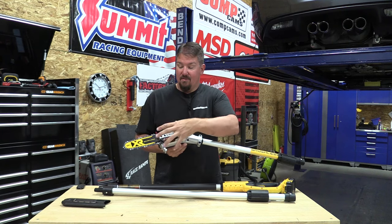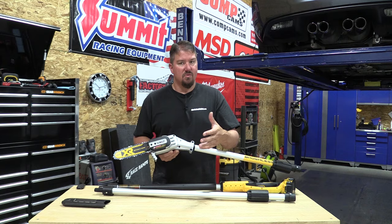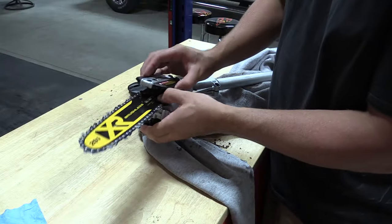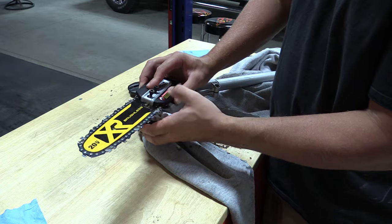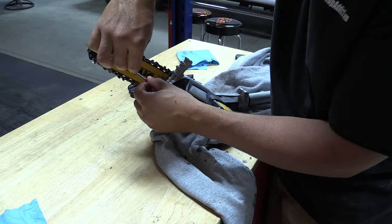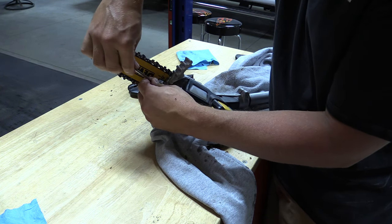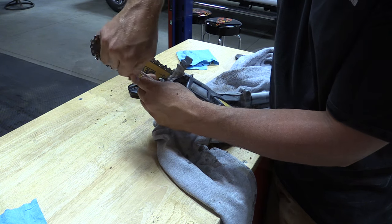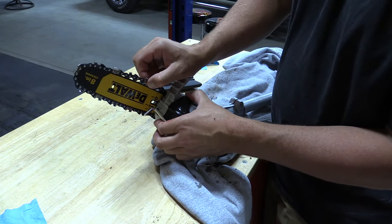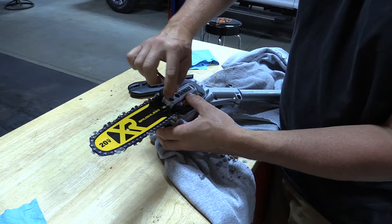In this system it's not an automatic bar adjustment, similar to what an old school chainsaw would be. Two bolts here — you can remove the cap, get at the chain, clean everything out on the inside. There is a tension bolt right in front of the saw blade. The tool that comes with it is like an Allen wrench, and it's a little difficult to get in there because you have to turn everything on an angle. Get out a normal screwdriver and it'll make life a lot easier. You can adjust the chain, remove the chain, put the different bar on — all very simple.